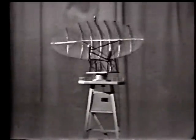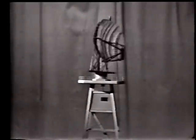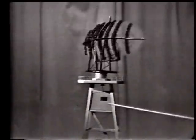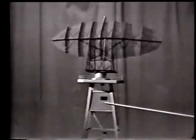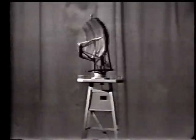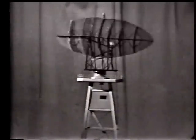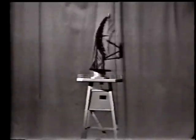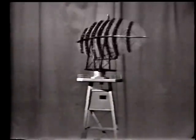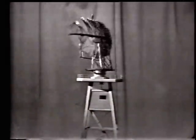Well, some of you say with a transmission line, and you're right. But we still have a small problem. It is not a straight line from the room to the antenna. Then, too, the antenna is rotating. Well, can you imagine what would happen if we connected a piece of waveguide from the transmitter to the antenna? You're quite right. We would have a waveguide pretzel.